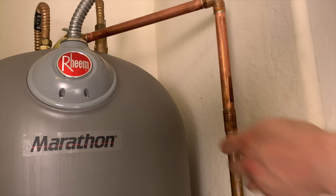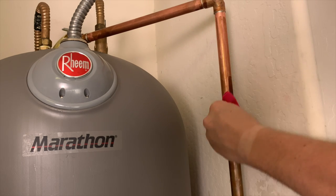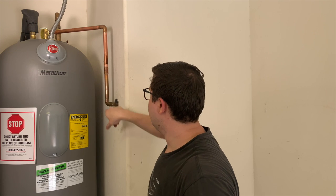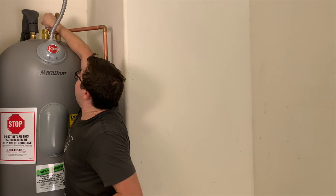I gave everything a couple of minutes to cool down, and now I'm just going to use a rag to wipe away any of the excess flux. My camera actually overheated while I was doing that last solder joint — I thought I lost the video, but it looks like I didn't. While the camera was cooling down: first, I turned the electricity back on. Definitely wait to do that until the tank is full — you'll fry your heating elements if you don't — but the tank filled pretty quickly, and I expect hot water in three to four hours. I also added a layer of insulation — the water heater came with insulating tubes, so I stuck one on the hot water output. I also tested the temperature and pressure relief valve to make sure my solder joints were solid and there were no leaks — you just pop that up and vent some of the water directly to the outside.